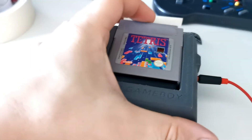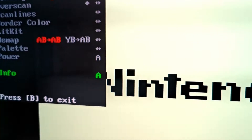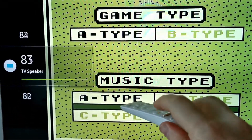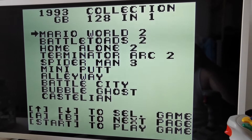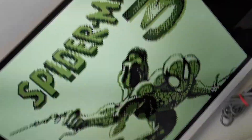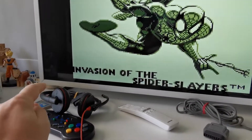Here we are investigating whether HDMI audio output is still linked to the headphone jack. As we see, it crackles while headphones are playing music. Unplugging the headset made no difference. Testing confirmed that plugging a jack into the socket does not influence and also does not turn HDMI sound off — the two work independently. We solved it. This is the reason why I kept the audio jack, and I recommend you do the same.